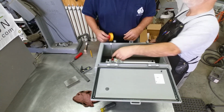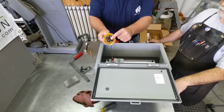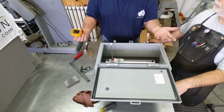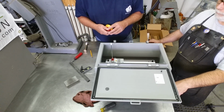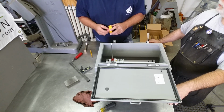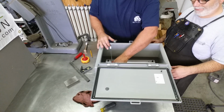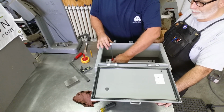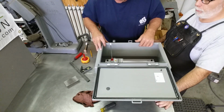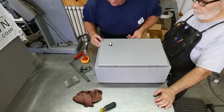Where's the center of that? Well, that's the trouble, and you know, need to go down to there. We've got an inlet cone here that helps guide it in. Remember, you're working off of an axis of a hinged door, so that throws another arc into the equation. I'm telling you, we could have just put this up on the mill and done it. We took care of it. The next thing is we've got wiggle room this way on our DIN rail. Yeah, did you see that? We go back and forth on the rail. Nice. And then that's going to help us with our alignment here.